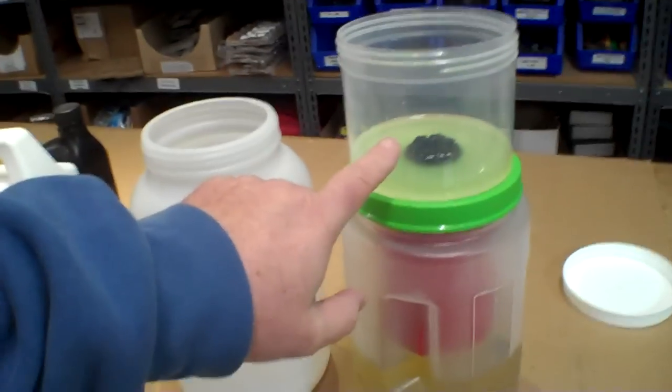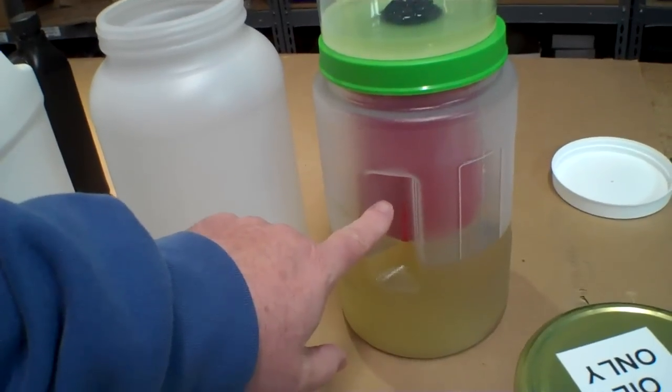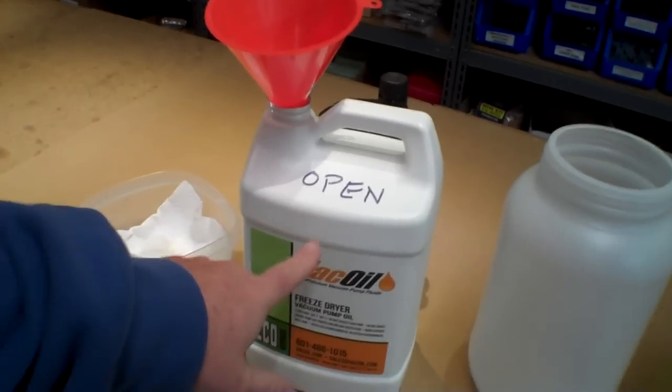There's one other thing to explain about the Harvey filter: since it has an oil filter inside, that filter itself holds about a quart of oil. So the first quart you put in to be filtered goes into the filter itself and you don't get it back — it stays in the filter. The second batch pushes that oil through and out. There's always one quart you lose inside the filter; theoretically when you change the filter you can turn it upside down to recover that oil.